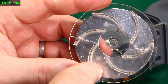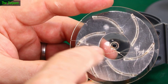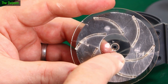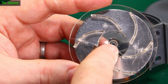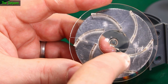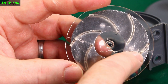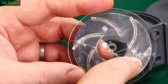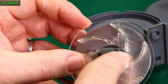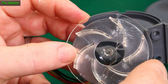Now usually what the weakness is - is the flow mark away from the gate, so usually running away from the gate. Those would be where they get weak. But it's actually cracked right across here, which is kind of from this gate in that direction and this direction. It should really be a weakness line going that way. It's not really fractured across the point I'd expect it to. That will be a weak point going in that direction, away from that gate, towards the outside. So that line there is kind of on a weak point. The way it's coming right across - it's not what I would have expected to happen. I would have expected to go like a triangle chunk out of it. But you can see that witness mark - it would have gone that way. Those are weak spots in the mould as well.